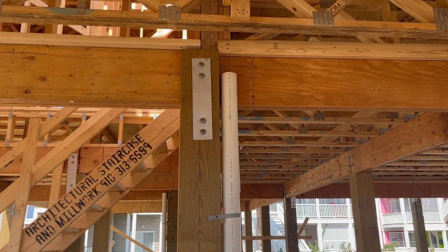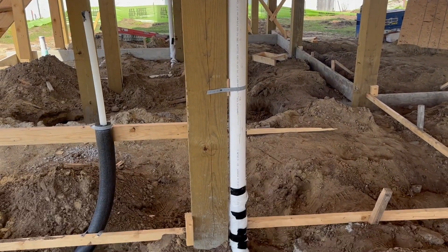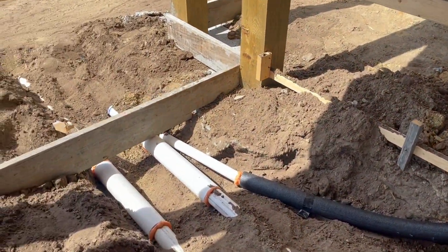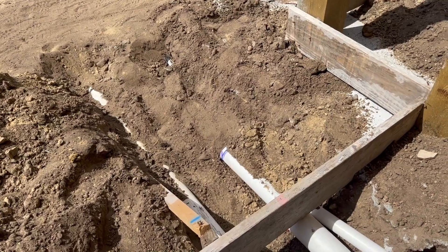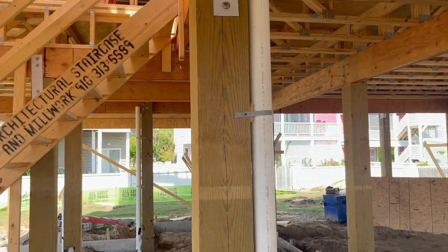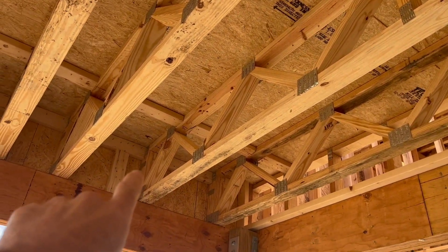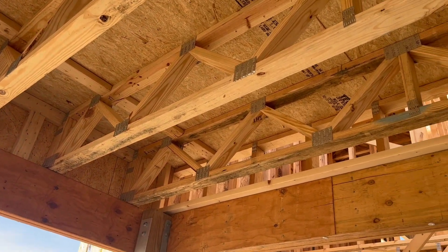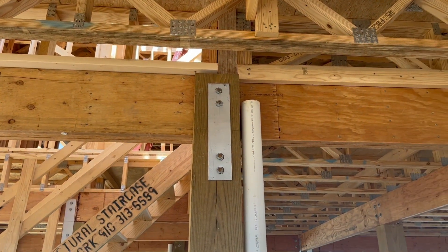We'll call this stack number two. This stack is going to serve one bathroom, so again it'll have five drainage fixture units on it. It comes down and I've taken it outside of the house right here. I'll explain where that other pipe is going in just a second. But this is stack number two — five drainage fixture units on it. This comes up and that bathroom is going to sit over in this general area right here. I'll show you all that on the rough-in. I don't want to get that stack too close to the bathroom, so I have enough room to get all the fittings I need to get it roughed in.